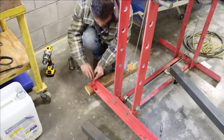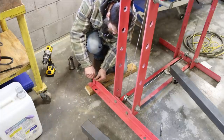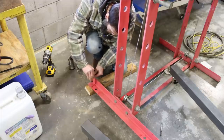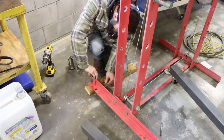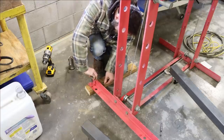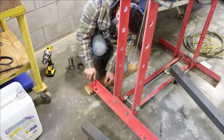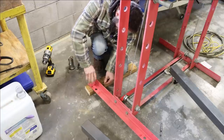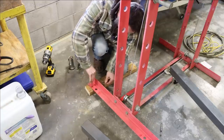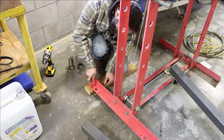So the casters that I'm using on this thing are really too light of a duty caster to hold this thing indefinitely. So what I'm going to do is put some threaded rod with some machine pads below the holes that you can see right beside the hole that I'm tapping there, that will actually take the weight when this press is in place, and then I can just easily let it down to set it on the casters and move it wherever I want it.